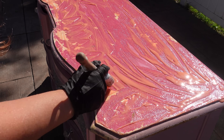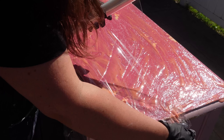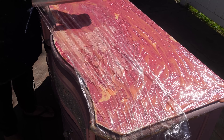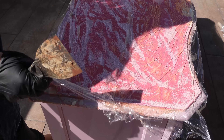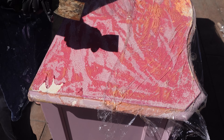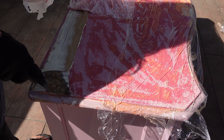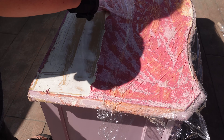I know there's a lot of water damage — a lot of water bubbles. I'm being really hopeful that everything is going to go well. I apply a pretty thick layer of citrus strip and then put some plastic wrap over it. 45 minutes later, I come back and it scrapes off really well, so I'm super happy about this. There are two layers of paint here — I think one is the factory finish and the other is the spray paint they painted on there.